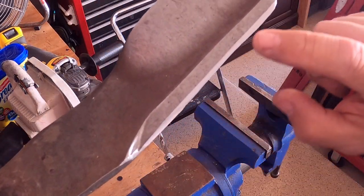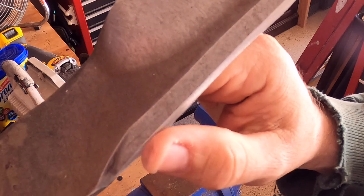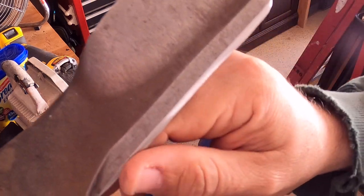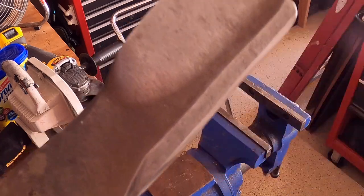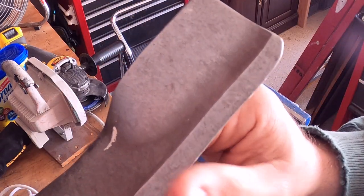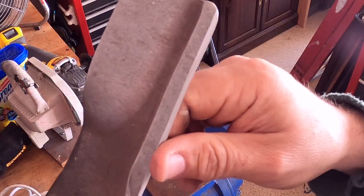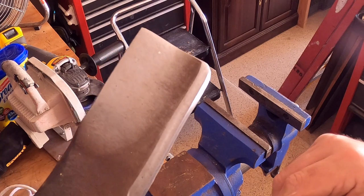I'm just taking a little bit off that edge. It's got a sharp edge to it, right there. I'm just going up about an eighth of an inch and trimming that sharp. This is where they started — it's completely rolled over. I just use that flap disc and take a little bit off here, just give it that little edge. That's all you've got to do — it's all I ever do.